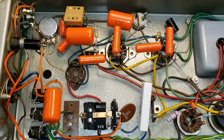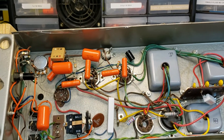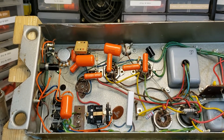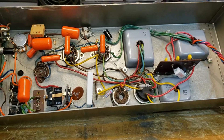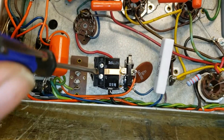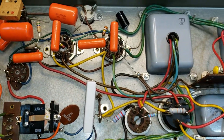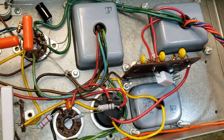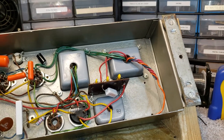As I stated in the previous video, this amp had been partially rebuilt by another technician out on the East Coast, but it had some things that needed to be done to bring it up to Hammond Doc standards. So I replaced the volume potentiometer, just put in a brand new relay, and put on a resistor here for inrush current.